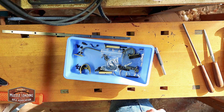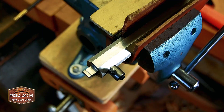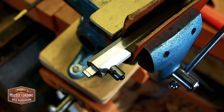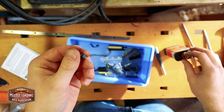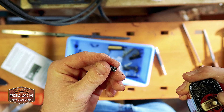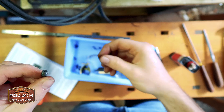The next step is threading our nipple into the bolster here. This is our nipple — you can see how small that hole is. This is where we're going to put our cap, and a little fire is going to come through here and ignite the black powder at the bottom of our barrel. You can also screw the bolster screw into the designated spot using a straight slot screwdriver and tighten until snug. Traditions recommends putting a little bit of oil on both of these thread sets just to make them easier to get out in the future.